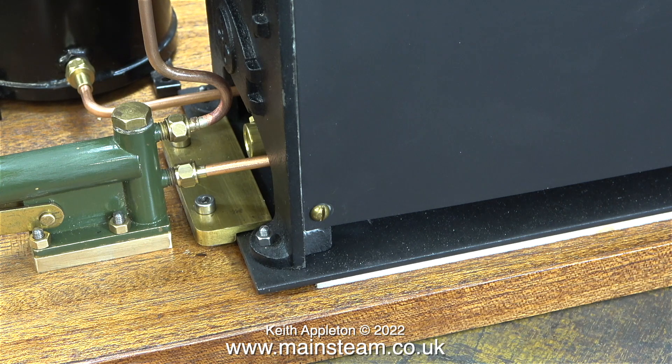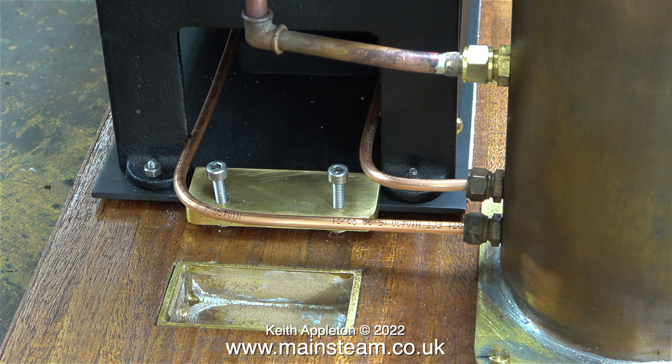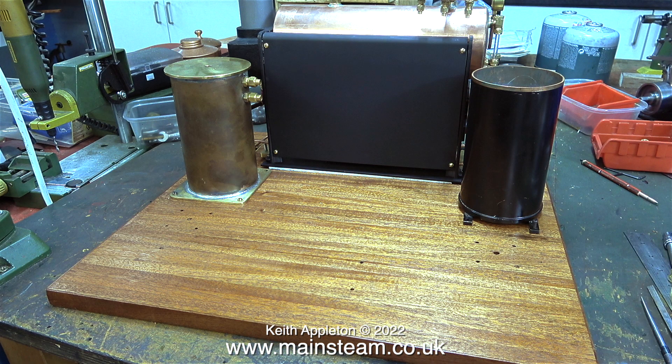The inlet to the pump is piped to one of the unions on the water preheater coil, and at the other side, the cold water feed from the water tank goes to the other preheater connection. I'm currently bending the piping and as you can see it's lining up quite well. The two long pipes going from the water tank and eventually back to the pump run down the side of the burner, so this water is going to get quite hot. There is quite a lot of piping on this plant and I will continue in the next episode.